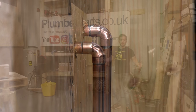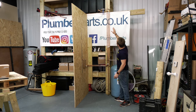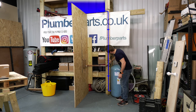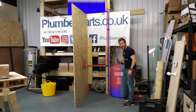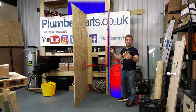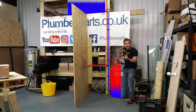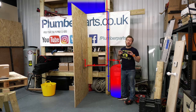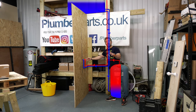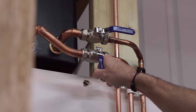Yeah, I know I've changed clothes - got to wash sometimes. So this is the system layout we've got. Obviously we've got our feeder tank up there - a massive tank of water that is going to feed cold water into our tank at the bottom by this pipe. That's going to get heated up by our immersion heater, which I've already got on now - that's getting lovely and hot. And that's going to come out of this hot pipe here and then go into the hot side of our shower valve. We've also got our expansion pipe up there - so when this hot water gets heated up and the molecules get excited, hot water expands so it needs somewhere to go and it just expands a little bit up that pipe. We've got another dedicated cold feed - really important to have that off into the cold feed side of the shower valve.